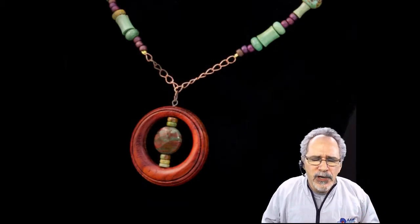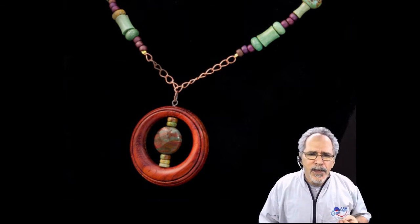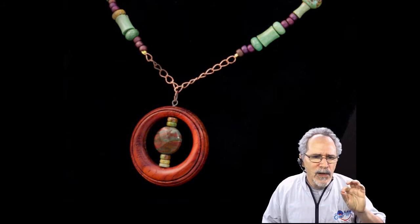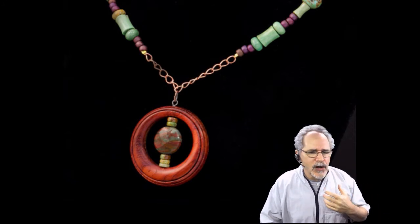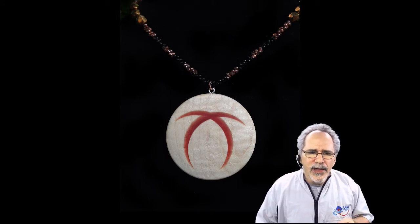This was a nice piece of padauk, and there's a piece of red and blue jasper in the middle, with a very small bead turned around the outside. I'll show you the technique to do multi-axis turning using a special jig. The arcs were scribed into the wood on the lathe, and then I filled it with inlace.